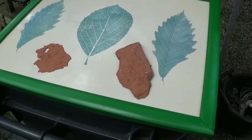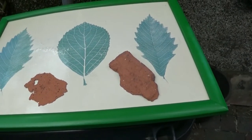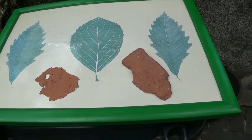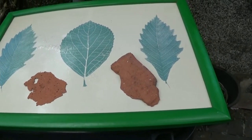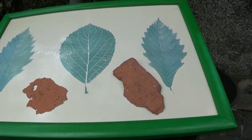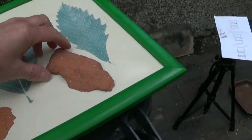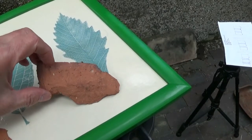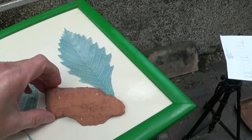I just wanted to do this little piece about brick spalling. I've sadly been nurturing and keeping these pieces since winter when I found them on the ground in the back street. This is pieces of spalled brick where moisture has got into the brickwork, the moisture has then frozen and blown the face of the brick by expansion. So there's the face of the brick and the part which has blown away from the main substrate due to freezing action.